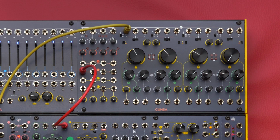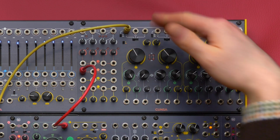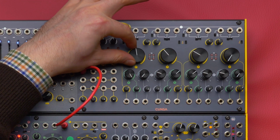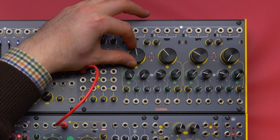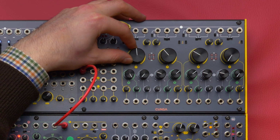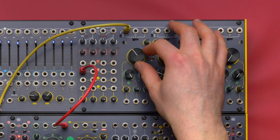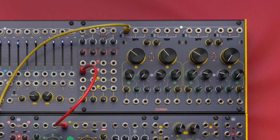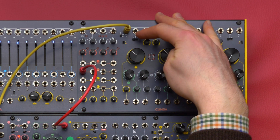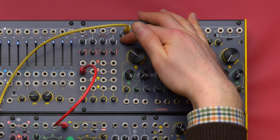If I want to have an even more liquid sound, I can use the 24 dB per octave, so going a bit off the Roland tradition, and have more emphasis on the cutoff frequency, thanks to the steeper slope. I may still have a bit of extra resonance whenever I approach the lower range, so I can activate the combo mode, as I was saying earlier, to have a much more tamed behavior here.